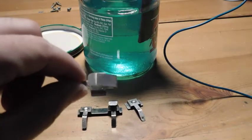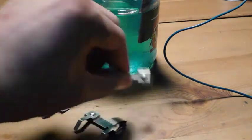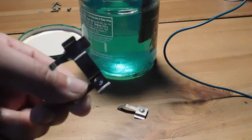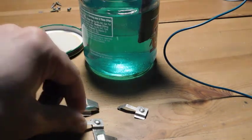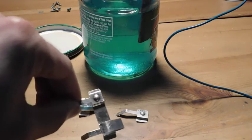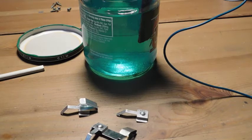The reaction is finished and they came out pretty decent — not bad at all. They're completely silver colored. I can see some nicks and imperfections, and that probably has to do with remaining impurities or hydrogen bubbles that lingered on the surface and created little pits in the metal. In this case I don't care about having a smooth polish — I just want something that will conduct electricity. I want to make sure that when I stick those batteries on here it works every time. I think we're going to accomplish that with these. I might give them a quick polish with some Brasso just to get rid of a little of the excess nickel and get everything smooth and consistent.